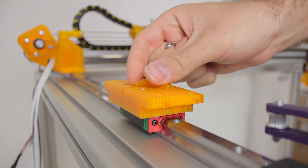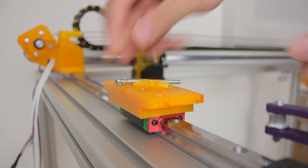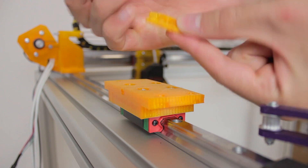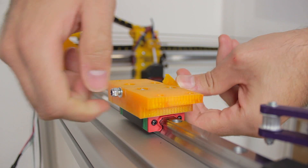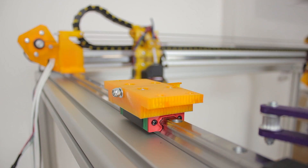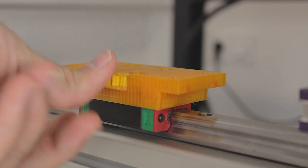Back to the Mega — the next parts are very important: the belt clamps that are going to be installed on each of the skates of the Y-axis. To install them we need an M4 by 40 millimeter bolt together with two M4 washers and an M4 nylon nut, combined with the 3D printed belt clamp, which you'll be able to download from the link in the description. We'll present it in place, since later we'll need to attach the GT2 belt. We repeat the same process on the other side.